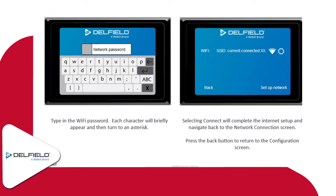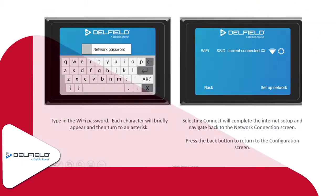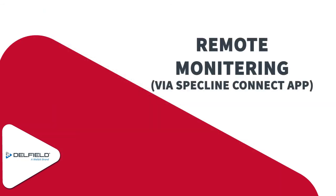So if you're at a pizza place and they have one of these units and you want to connect it to the Wi-Fi so you can do some monitoring of it, you're going to put in whatever their password is for that network. So if it's pizza 300, you're going to put in pizza 300, and that's going to be your password there. Once you're successfully connected, it'll show you the network that you're connected to, along with the signal strength as well. Then you'll press the back button, and then you're ready to do remote monitoring.